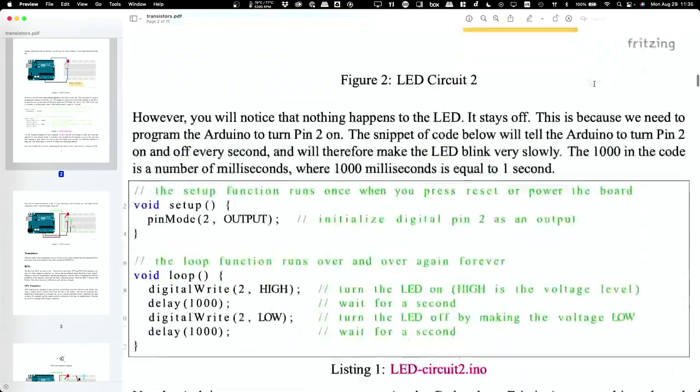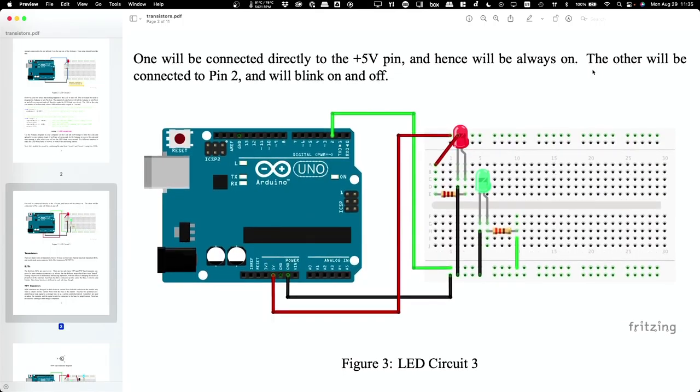All right, so let me go back to the picture. There, okay? Okay, so 2 LEDs, 2 330 ohm resistors, and a general rule of thumb is if you're driving an LED, it's pretty much always gonna be a 330 ohm resistor, okay? So you'll need 2 of each of those, and then a handful of wires. The other thing is that the wire colors don't have to match what's in here. For example, I don't think there's a bright green in there. This is just what the software had. But I've tried to stick with the convention of using 5 volts for red, ground to black, and other things with other colors. But it's not perfect, as you guys will swiftly find out.